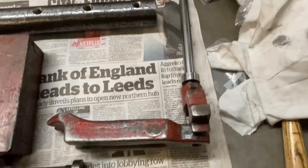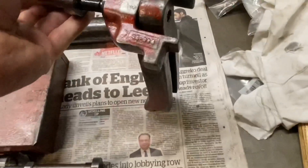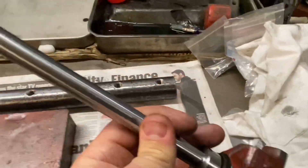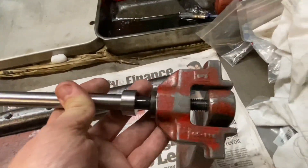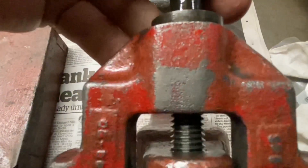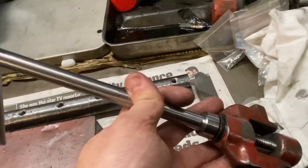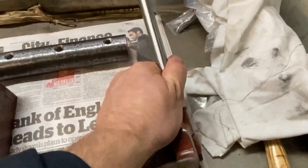That's the foot that goes in the machine that does the clamping. I've modified this as well — the original one was well worn out and the thread was pulled right off it. So I've made a new one out of EN24 material and threaded it to match. You can see there's no problem with the thread on that one. Being EN24 it's a little bit harder — it's half-hard steel — so it's a lot stronger than the original mild steel version. That modification will outlast me, no doubt.